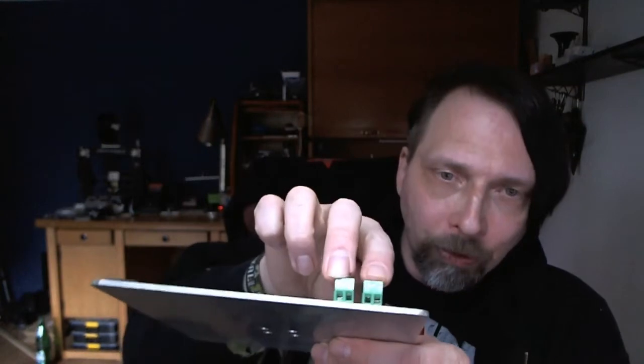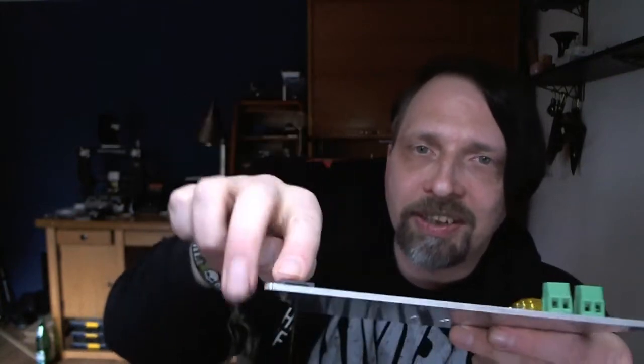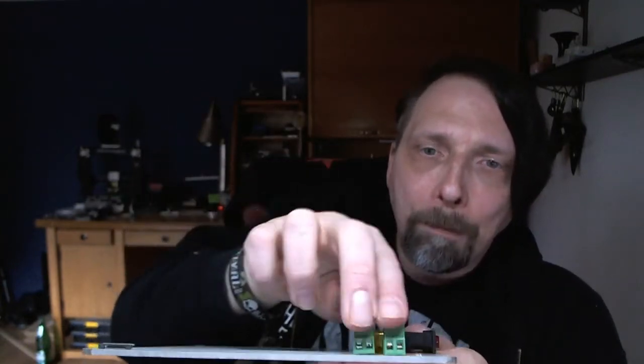My first thought was, okay, you just need this external power supply to get this range up, but it isn't that way, because these both posts where you put in the external power supply are a different heater than this one. That means you can run both at the same time, and this also means that it gets hotter with both of them, and they have no problem if these are two different power supplies, even if they are two different voltages. There's no problem. So this is for that.